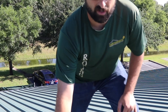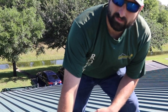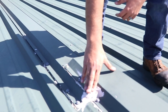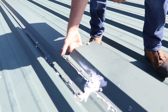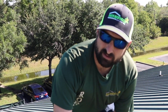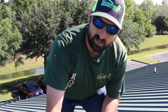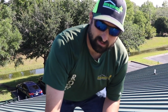This is something where a roofer has just made it work, but the owner has spent thousands of dollars looking for something that's lifetime. This is not lifetime — this is a lifetime of problems, not security. If you can see, there are a lot of gaps where my hand can go under, where wind can blow water under, because it's not customized — it's not built just for this building, it's built for a variety of buildings. That's the difference between custom metal work and making something fit that's not designed for that.